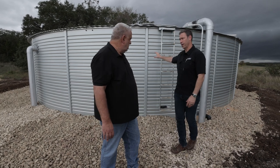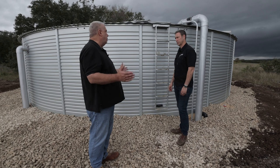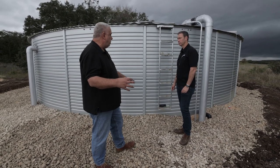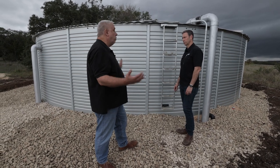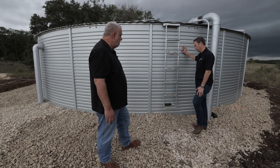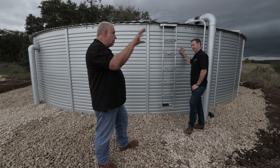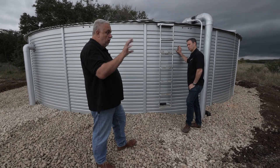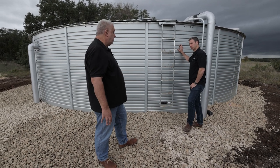Now, do you know anything about the liner that's going on in here? No, but it looks just like it. Basically, it looks like a pool liner. If you climb up, there's a little hatch there in the pump. Goes across the bottom of the floor of it, but it's basically just a round above ground swimming pool that you're not swimming in. And did a rainwater collection contractor size this 55? Was that a homeowner decision? Yeah, I think it's based on what type of plumbing fixtures and what type of demand sequence the homeowners said, you know, we would typically do this and that, and then we'd set up this system.